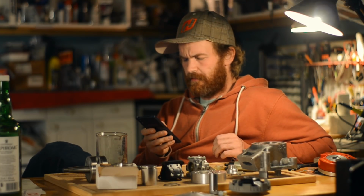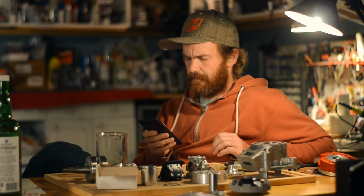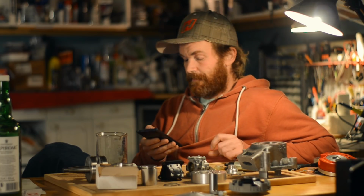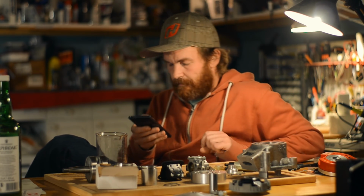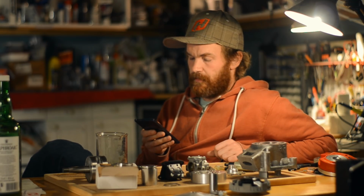I didn't like the way you stopped the piston to remove the clutch. You can put dents in rod pins and possibly squash ringland. Yeah, that might be a problem. Might be part of the issue with the squashed ringland and bent or broken bearing. Might be from a bent rod from doing that. So yeah, I'll stop doing that. I'll use something to hold the variator and or an impact driver to do the ignition nut. Has worked fine for me for years though.